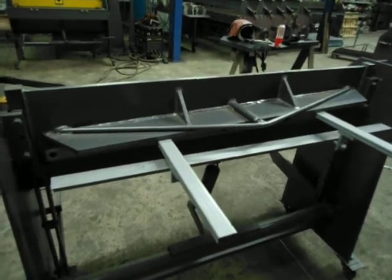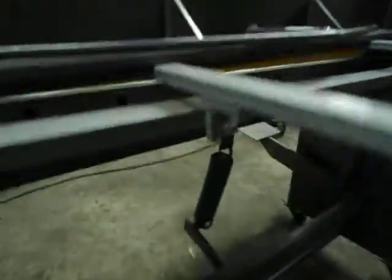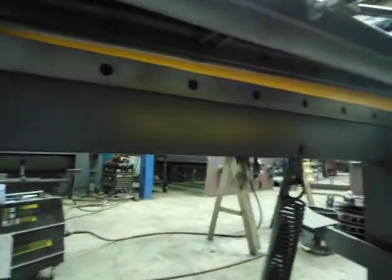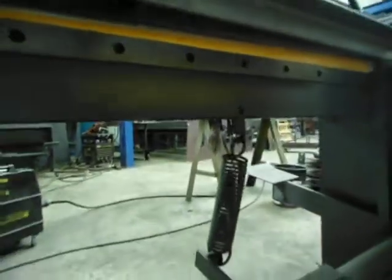We've got some nice long backstops out here that you can set for multiple cuts. We've got stainless quality blades underneath here that allow us to cut stainless steel up to 1.2 mm, and we've got a nice solid torque tube down the bottom there.